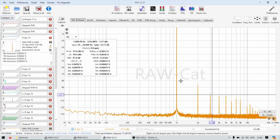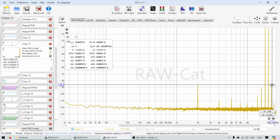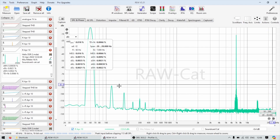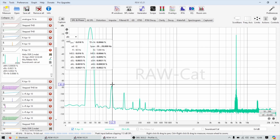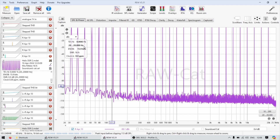Everything is below 100 dB, so it's perfectly clean. The DSP is very very clean at same at high frequencies. For intermodulation at 18 and 20 kHz, all harmonics are at 85 dB and lower — perfect, very very good. The lower frequency intermodulation as well: 90, 87, and lower. Multi-tone distortion gives us 15.96 bits, which is essentially 16-bit CD quality.